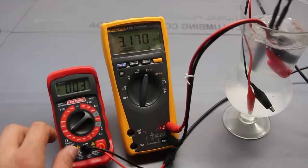And I should not hear any noise on these two. They should be completely separate. So as expected. So in very short order, we were able to basically find out the internal schematics for this guy right here. I didn't need to look it up on Google, just simply by using the continuity or the resistance reader.